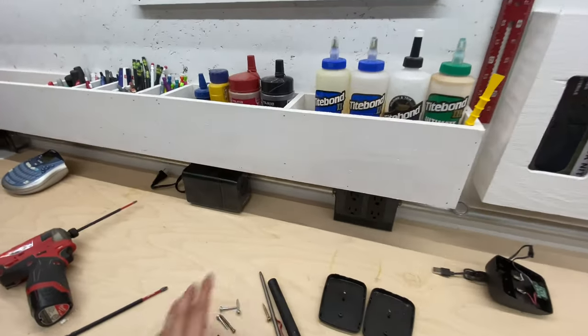This is all super rudimentary — I literally just make pieces out of plywood scraps, use the square to keep everything at 90 degrees, and nail it together with the cordless brad nailer using about one-inch brads, since the dividers and sides are half-inch plywood. Nothing too crazy, pretty simple, but it keeps things super organized — which is the way I like it, probably borderline OCD, but that's okay. If this helps you guys out with your build, make sure to like, comment, and subscribe, and we'll see you in the next video.